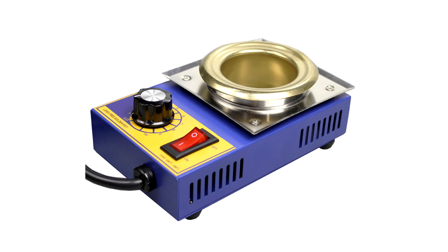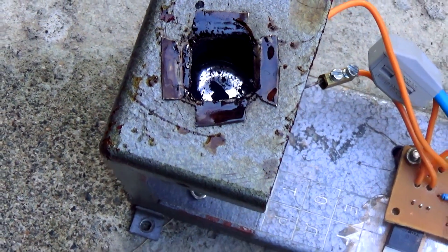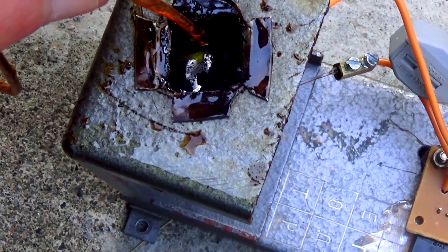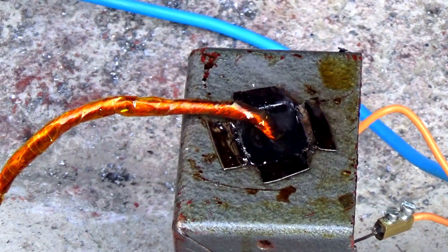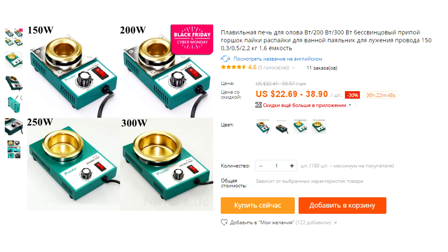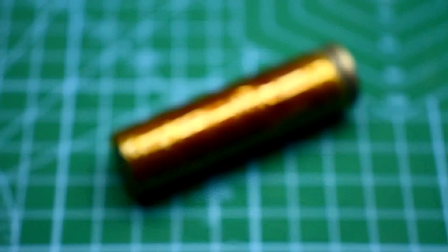The third way is a tinning bath. This method is used in industry as the fastest. The solder is placed in a small metal vessel which is heated to the melting point of the solder. The wire that needs to be cleaned and tinned is submerged into it. After some time the varnish burns out and the wire is covered with a layer of solder — no additional effort required. The disadvantage is also the release of acrid smoke, but done under a draft fan or outdoors it is manageable. Such baths can be bought at any online store; they are not too expensive but not very cheap, so it makes sense to make one at home at minimal cost.